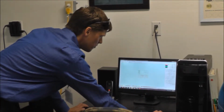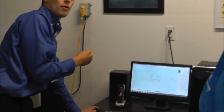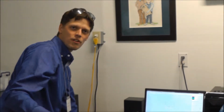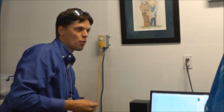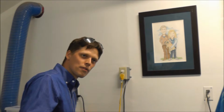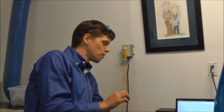You adjust all the numbers so you can tell the laser to move the head faster or slower depending on how much heat it's going to take to burn through your material. So really thin material like paper, you want to go really fast, or you're using a thick piece like a 1/4 inch piece of plywood, it's got to go pretty slow to burn its way all the way through. You can also set the laser purposefully not to cut through, and that way it'll do a scribe line into something, so it'll give a little detail without going right through it.